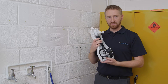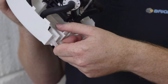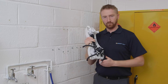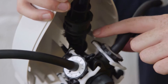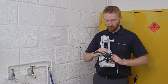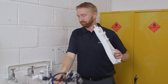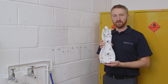The next thing to do is to unclip the non-return valves from the bottom of the back plate. Then you need to release the retaining clips within the back plate, and that will allow the internal assembly to come away. That leaves you with the back plate ready for the installation.